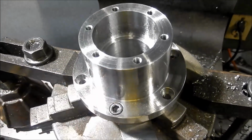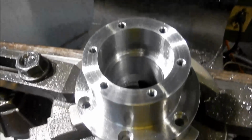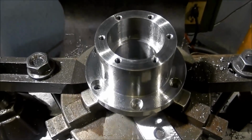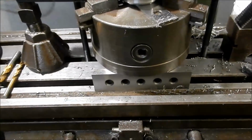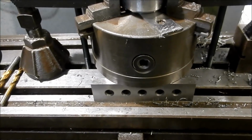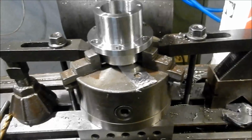So that's our M6 socket head cap screws that fit in there quite nicely. There are M5s, as you can see we're 30 degrees rotated apart. Just for the setup on this, I've used my 3-jaw chuck out of the lathe. I've got it sitting up in parallel to get it up off the D14 pins, and a couple of table clamps lock it down quite nicely.